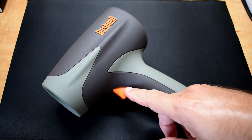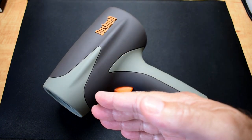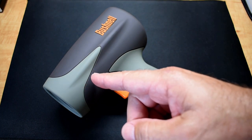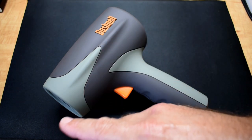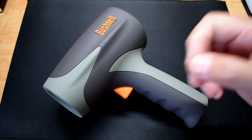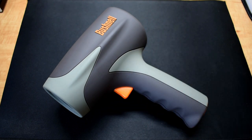When you squeeze this trigger, microwaves are generated on the front side of this radar gun, aiming towards the target. When those radio waves strike the moving object, they're going to be reflected back to the gun. The gun is going to calculate the shift in frequency between the radar that was sent at the vehicle and the radar that was received coming back. There's a microprocessor inside the radar gun that does the calculation in a fraction of a second. The radar gun works proportionately, so objects coming at you or going away from you can be measured.